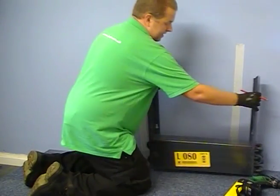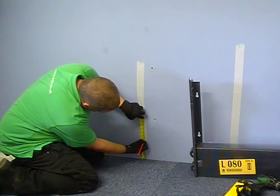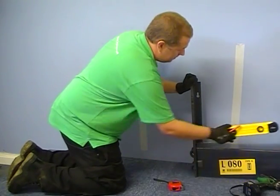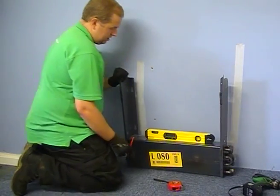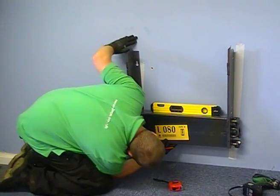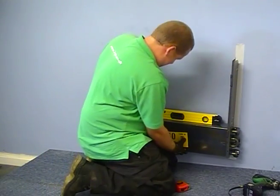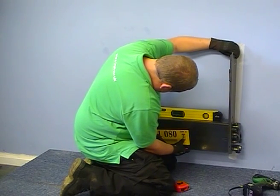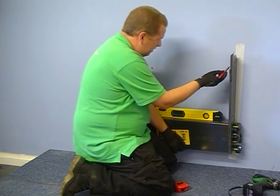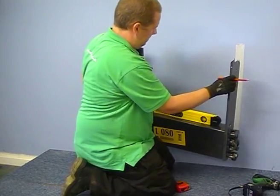This particular product needs to be mounted 100mm up from the floor. I'm going to actually mount it 150mm up knowing that I've got a bigger skirting board than 100mm. I'm going to check that it's all horizontal by putting the spirit level on and lifting this up to my 150mm mark.